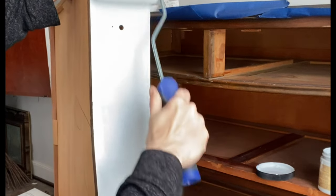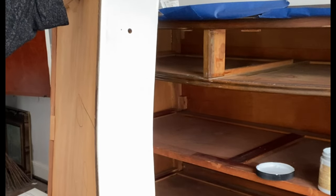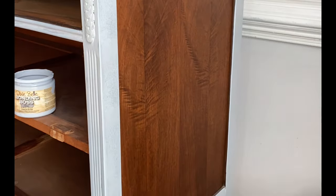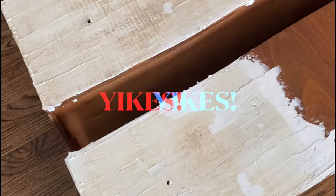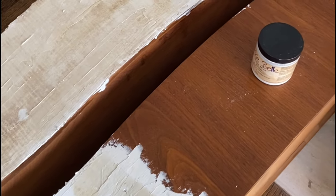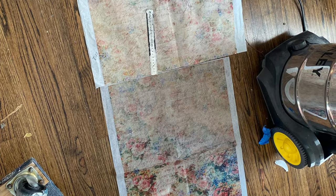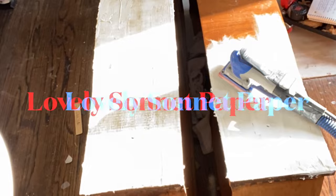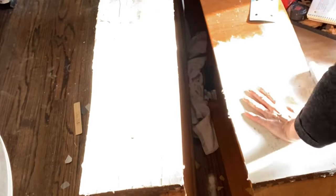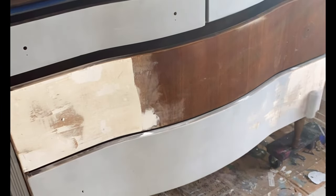Just because this is a new product, I'm going to fill you in on some of the details for usage of Bonding Boss. It follows the same rules as Slick Stick used to — you're going to need to wait 24 hours after you apply your Boss before you begin to paint. Because this is your Bonding Boss, your Slick Stick, and your Boss all in one, it's an essential step in the process. Make sure you wait 24 hours before you paint. The mud is going to be fairly smooth but definitely not perfect, so I'm going to use decoupage paper over top of these two drawers to hide any of the flaws. You can see me sanding back that mud to completely flat — it turned out pretty good, but it definitely needed a coat of Bonding Boss to lock it in and seal it before paint.